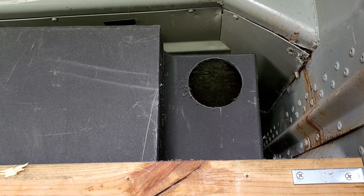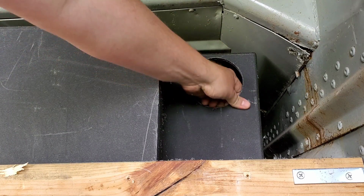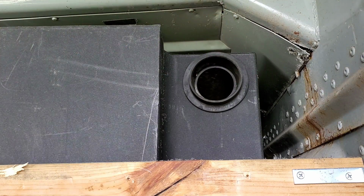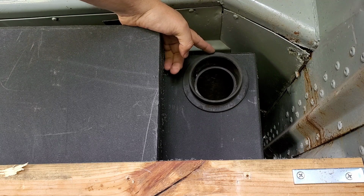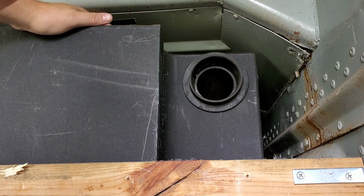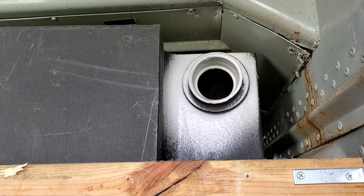The small ones, which are 1.5 inches, I'm not worried about because they'll come out the valves. All you do is you put those in there and you jam your pipe in there. Now, I didn't actually seal these. You can seal this to the tank and then put your pipe in there. I didn't. I'm kind of relying on it to do what it's supposed to do. Then I spray it down with just glass cleaner, basically just to make it kind of slicker.